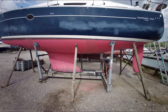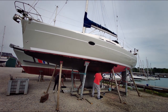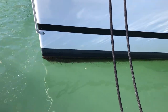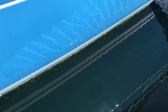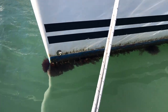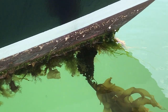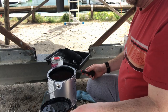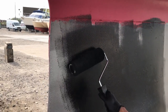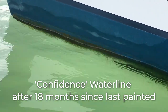The main reason for an annual lift-out is to clean and inspect the underwater part of the boat and apply a coat of protective paint to keep the weeds off. Biological fouling is the accumulation of microorganisms, plants, algae, or small animals on your underwater surfaces. This fouling can occur almost anywhere water is present, and at best it can slow your boat down, cause decreased fuel efficiency, and reduce the flow through water intakes. But at worst it can damage your hull. The normal method is using paint that contains a biocide to prevent growth, but these biocides are typically only effective for around a year, so at some point every season you need to get her out of the water, clean off the mess, and apply a fresh coat of paint.